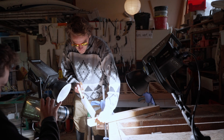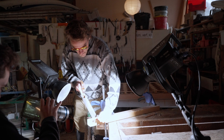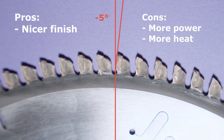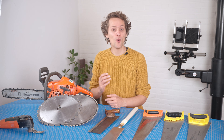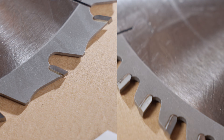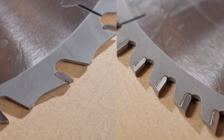You can see that the tip is sharpened with a less aggressive angle than the teeth later on — that's so you can easily start a cut without the saw grabbing the wood. Negative rake angles like that take more power to make a cut, generate more heat, but they leave a nicer surface finish and generally dull less quickly. So they are used on saws made for finishing work or for hard materials like the 100-tooth blade shown earlier.